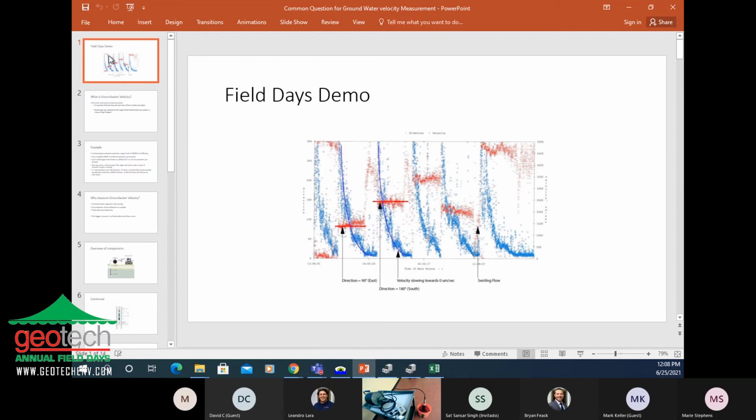And also thinking, it's moving in a certain direction. You want to control the plume. Oh yeah, you could definitely quality control your cone of depression in your area of influence by putting this in a monitoring well nearby, a remediation well. You could see if you were actually influencing the water towards the remediation well. Right. Yeah. That would be a good application.